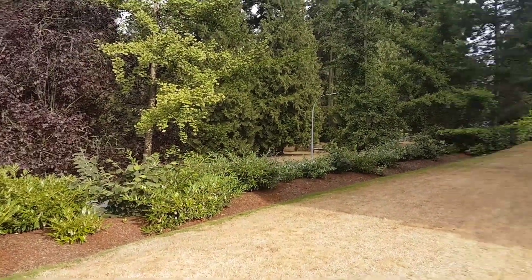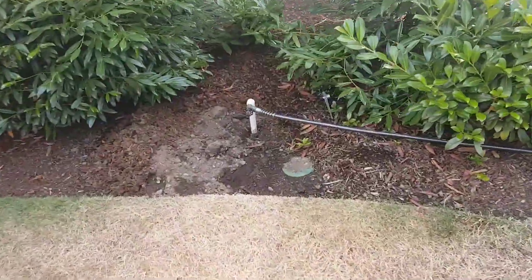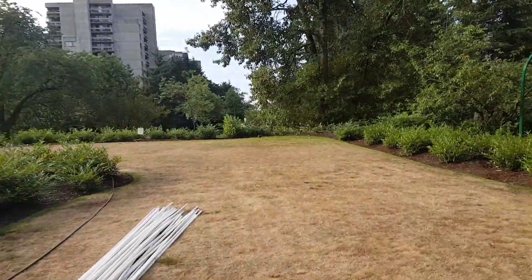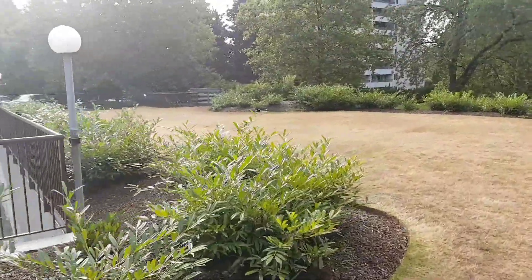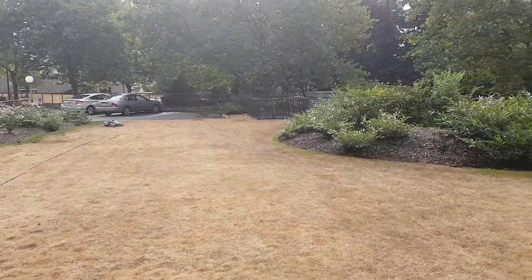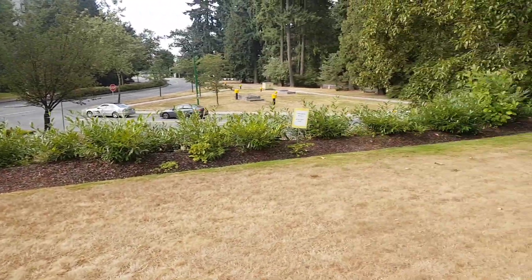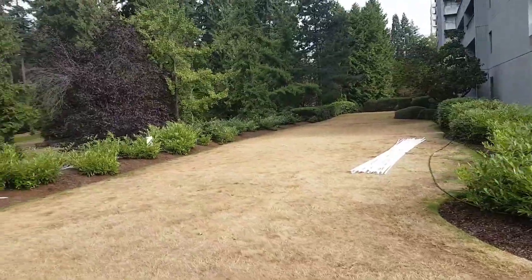Two to three rows of drip line — two rows along the back. We've got a hose pit here, and in that valve box we've got some wires. The main line, inch and a half, is actually right there, which is very convenient, and there are extra wires which go all the way back to the timer. Down this side we have a main line that comes out with a shut-off, so I can shut the water off without even going downstairs to the underground. It's really straightforward — basically just dig along the perimeter, put rotors in, and bring a line for the drip.